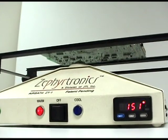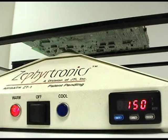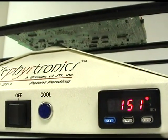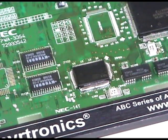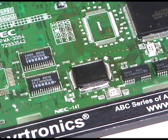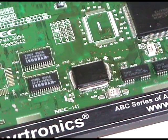It's important to be reminded that while we are working at the top of the board, the PC board is being preheated from below at the low temperature of 150 degrees C. Returning to the top of the board, look at what is happening here. The low melt desoldering wire has co-metallized with the old existing joints, bringing down the melting point to such a point that we're now ready for component removal.